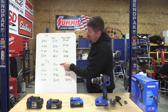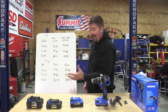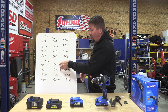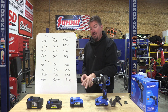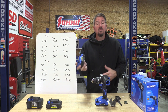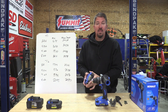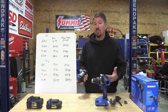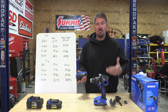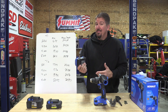It's pretty impressive, especially in the low range: 17.14 and 17.76. That's just with a bigger bit, obviously less pressure on the battery, but it's still holding close with that power draw. Those two batteries were very close, which leads me to this: the 4 amp hour battery comes with a lot of the kits, and it's going to give you more run time than the 2 amp hour. I appreciate that they put it in many kits, because the 2 amp hour is more of a specialty lightweight overhead-use battery. The 4 amp hour extended is decent, but not really good.